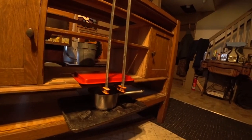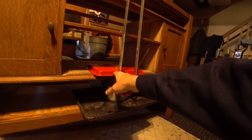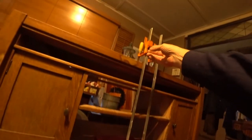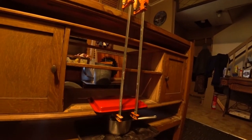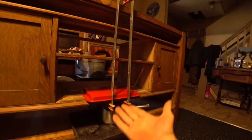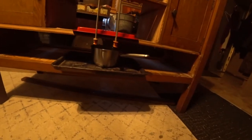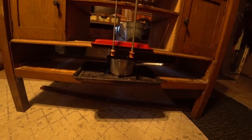It seems to be working pretty good. The steam was actually dripping down after it cooled, dripping off the tray and hitting the bottom, so we added a sheet down here so it won't affect the bottom wood. I also increased the tension on the clamps a little bit more to put more of a bow in there, so that when I release it and it dries it'll over-correct and come down. I keep exchanging the water in different kettles so we have consistent steam coming off.